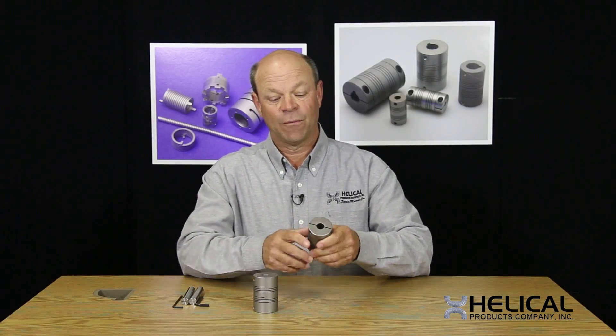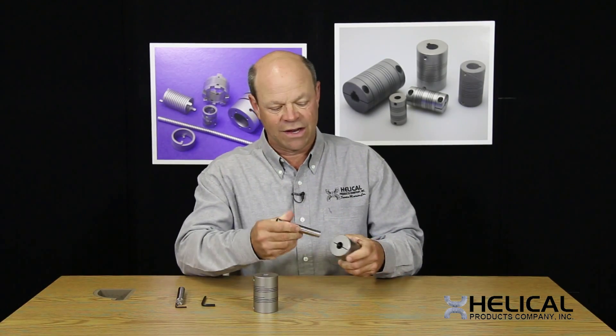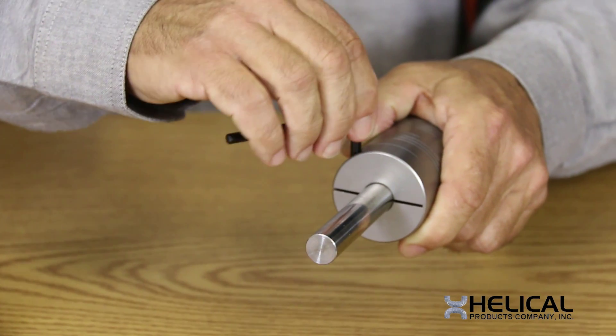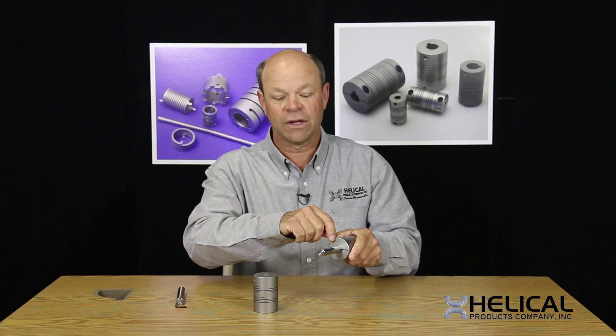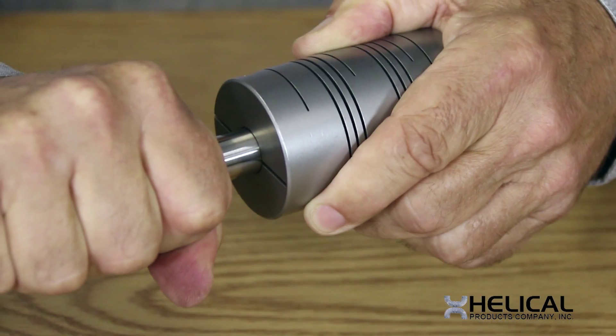With a clamp attachment it is held on by friction. I have a shaft here — there is a cap screw offset to the side, and when I put the shaft in I tighten up the cap screw nice and snug. We provide you the torque rating for the cap screw in the catalog, and then the torque is transmitted again just through friction.